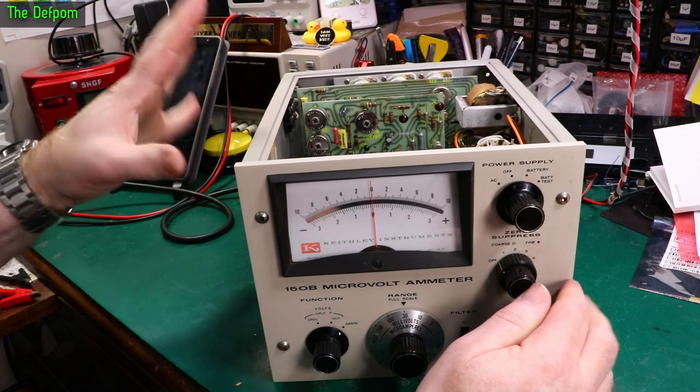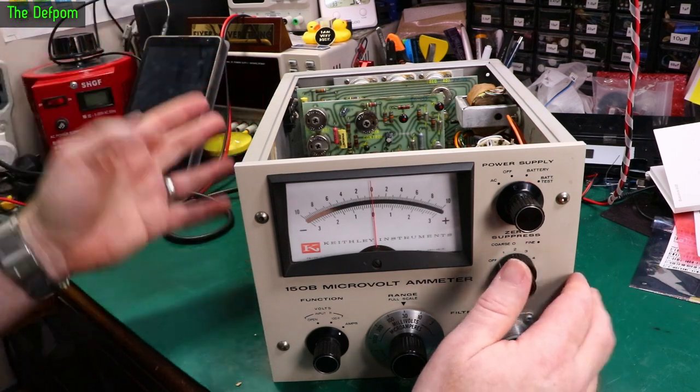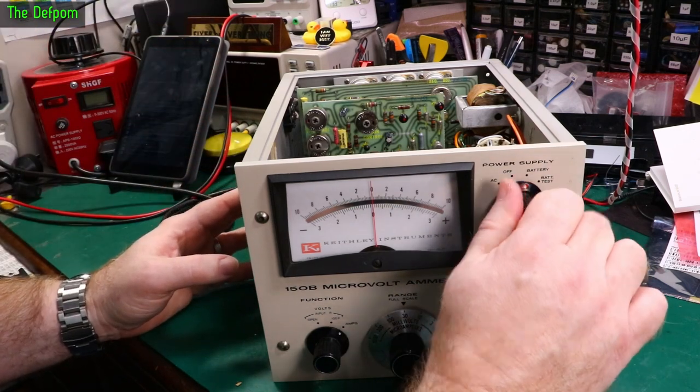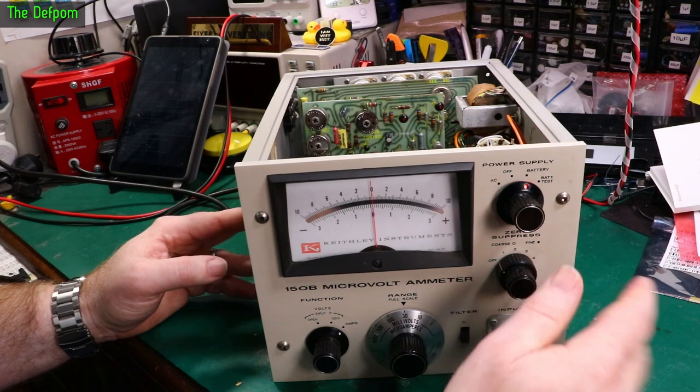And I should see a voltage of around 14 volts or so, roughly, because there's no loading on the circuit, so it's going to be floating at a higher voltage. And that will confirm then the charging circuitry is working. And then we can actually connect the battery up and see if it actually works.